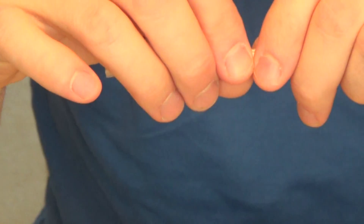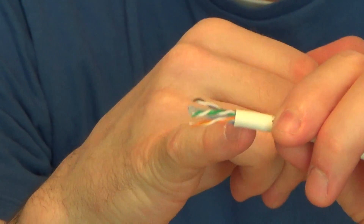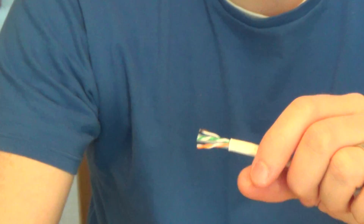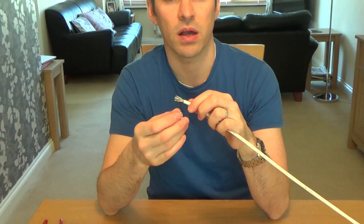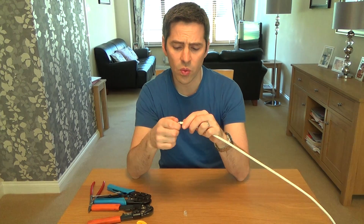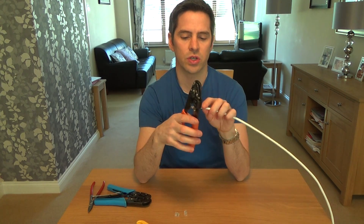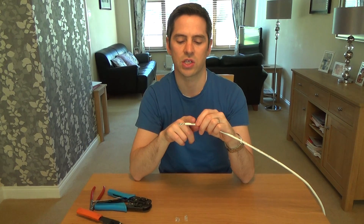Some cables have a drawstring so you can pull it back and also know you haven't damaged the edge. The only problem is when dealing with these plugs — because there's such a tiny amount of room — you want the sheath to be as straight as possible. If you cut it diagonally and jagged, when you push it into the plug the left-hand side might go in but the right-hand side be hanging out, and as soon as you bend the plug a little bit it's just going to fall straight off. So get a dead straight line — you can use strippers or use the blade on your crimpers to score it and get as straight a line as possible.